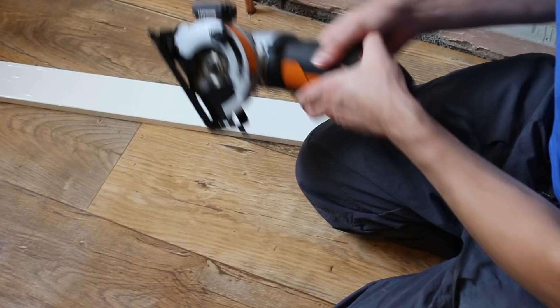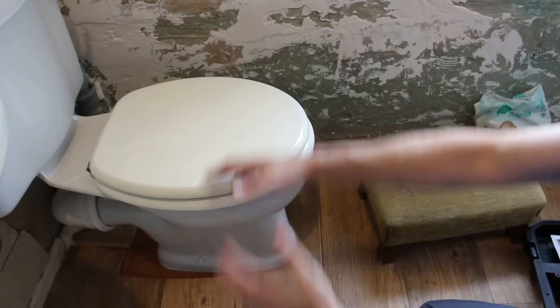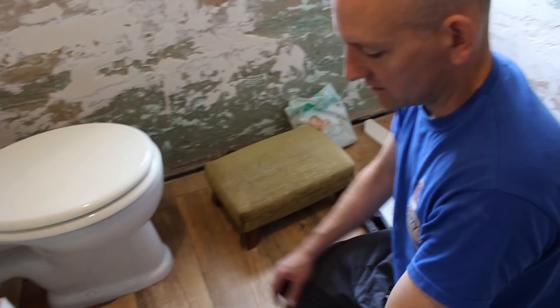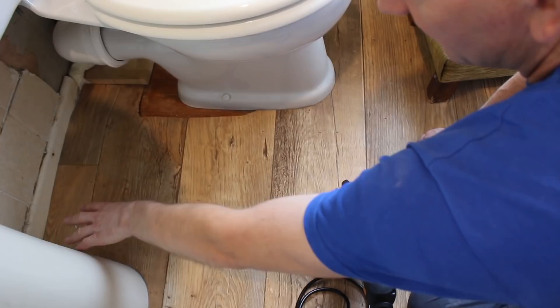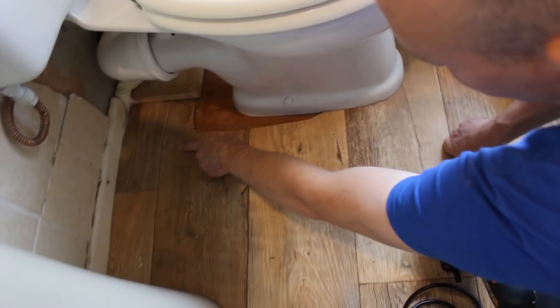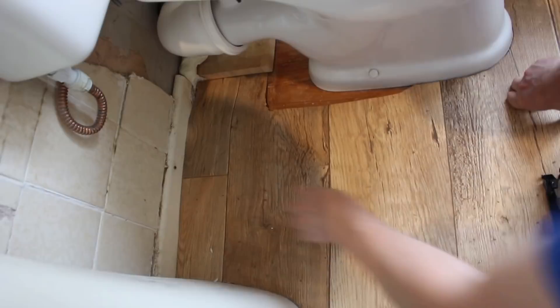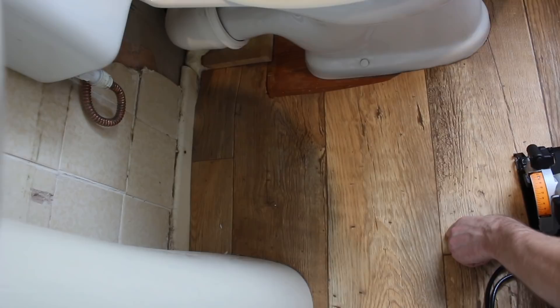When I need to cut - a bath will go here as described in part one, the toilet with new seat goes here - if I have a problem with the waste or a leak underneath the boards, at least with this I can cut along here exactly along the joists and screw that portion of board down so it can act like a hatch that can easily be lifted. If I screw a complete board down I'm pretty much stuck, but if I plan an inspection area around where the joist starts, I can lift an area just in case of a leak - making life a lot easier for everyone in the family.